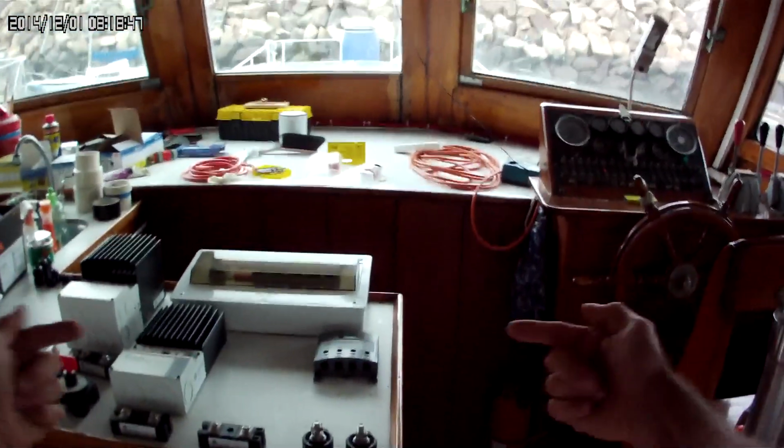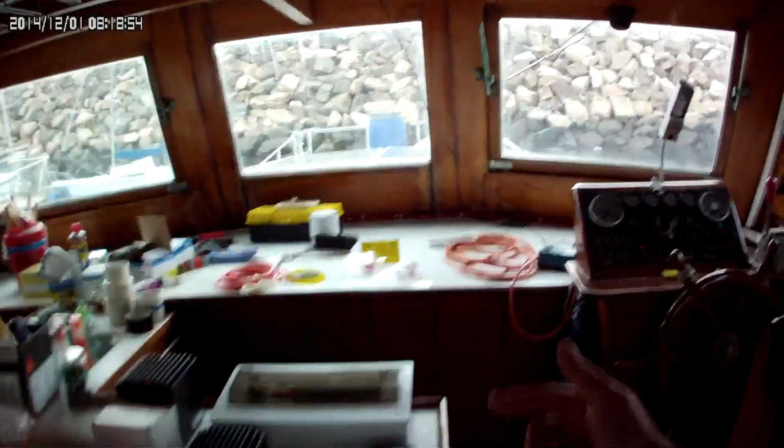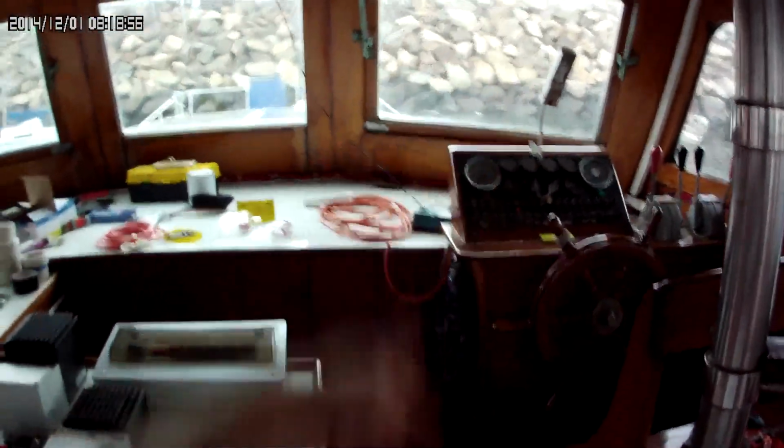Now, that's going to be right here, so it's probably about 1.5 meters, but right below this, on the inside, you've got your two engines right here. But there's a 150 liter water heater that I'm going to install there, and it's horizontal. On each side, on the lower end, I've got 2 bungs, so I can put in 2 elements. Plus, I also have a heat exchange coil that goes all the way around it.